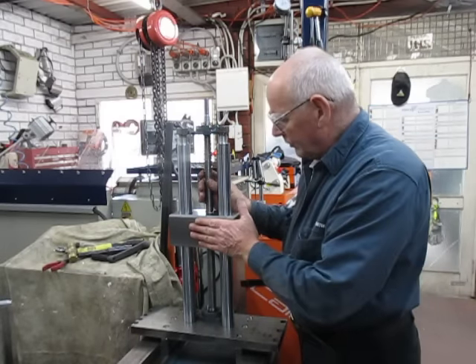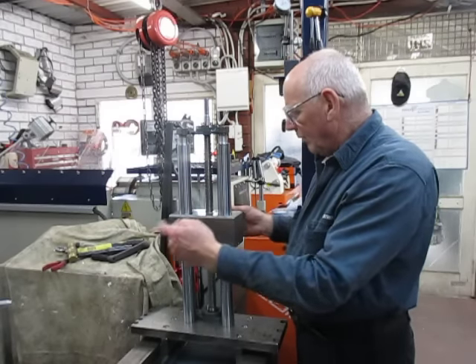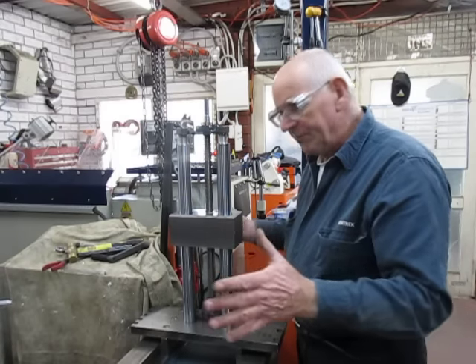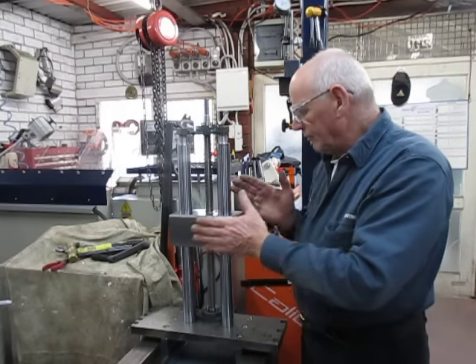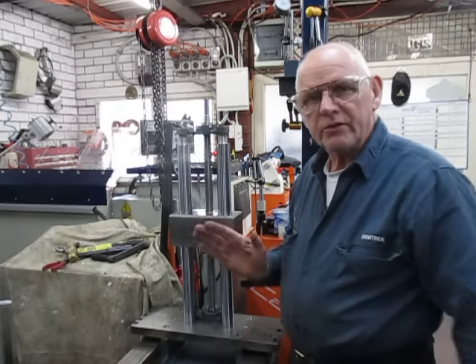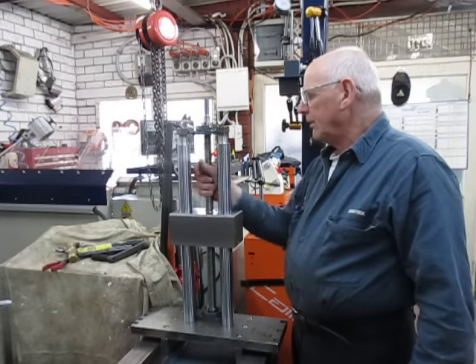There's been a lot of talk about having a bore all the way through and putting the bolt on the side to allow clearance for the shaft. But being that this machine is quite small anyway, I don't have a problem moving the block back to be able to put the boring bar in. We'll probably end up with only one length of boring bar anyway.